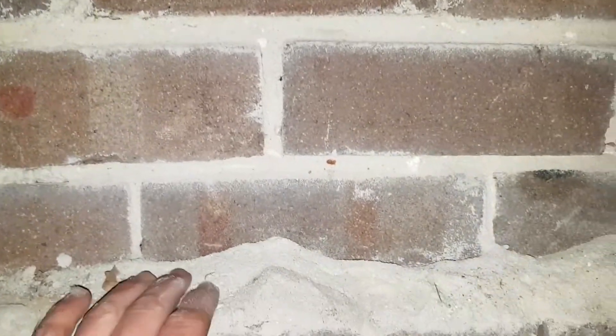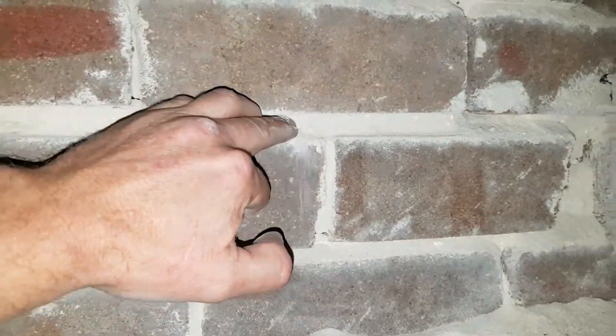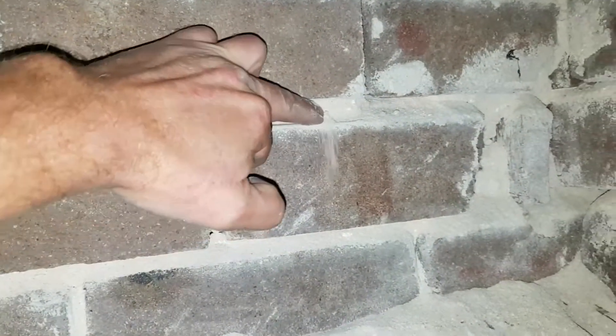We're just under a house here in the inner west. The main problem with rising damp is the salt that it brings with it. When salt dries it crystallizes and turns your mortar and your bricks to dust — similar to how when you put a beer in the freezer it expands and pushes apart the glass. The same thing happens with the salt: when it gets inside the wall it pushes all the mortar and the bricks apart from the inside out and turns them to dust.